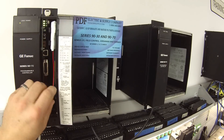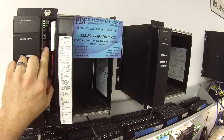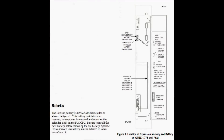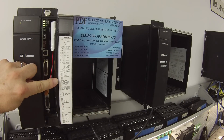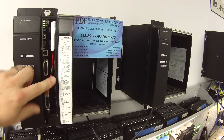I'm going to go ahead and plug this in. There are two connectors, and the reason for that is if you ever need to change a battery, you want to leave the old one connected while you plug in the new one before you remove the old one. This way there's no lapse in having the CPU, processor, or programmable co-processor unprotected. It's also indicated on all the door cards — it says install new battery before unplugging old battery. Please keep that in mind; that's very important.